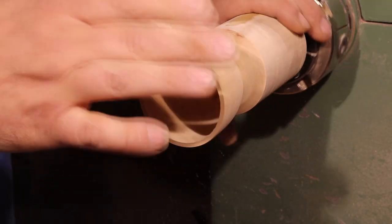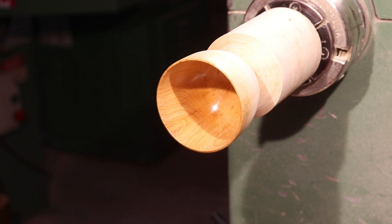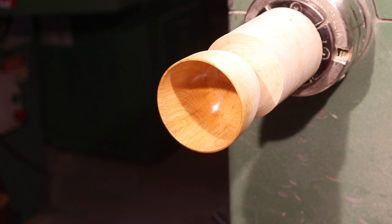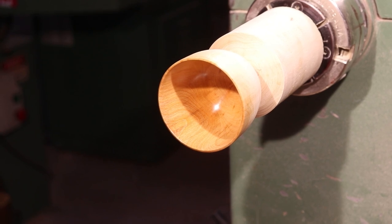All righty, I'm gonna sand this up and I'll bring it back. All right, got a really nice finish on the inside now. I sanded it up at 320 and I used Yorkshire Grit regular microfine and I put Hampshire Sheen High Gloss in the middle and I'll show you how to use those on the outside.